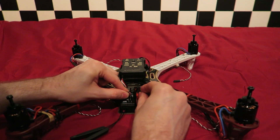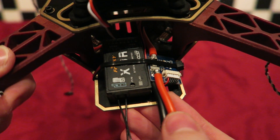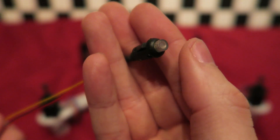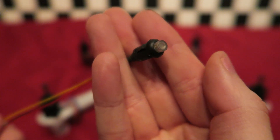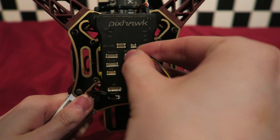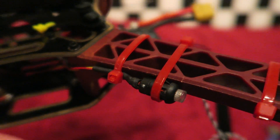For the moment I'm going to cable tie this down along with the receiver. The next connection is the arming switch. This is a new mandatory safety feature and it plugs into the switch slot on the Pixhawk. We have to press it before the copter will arm. I'm going to cable tie this to the frame for now.